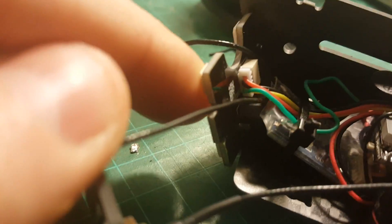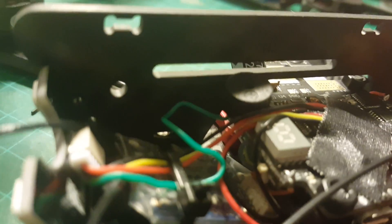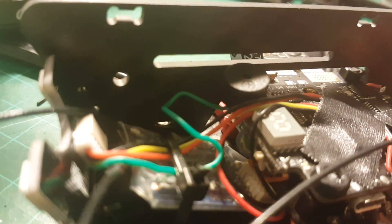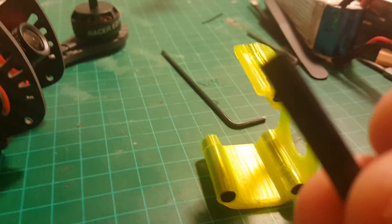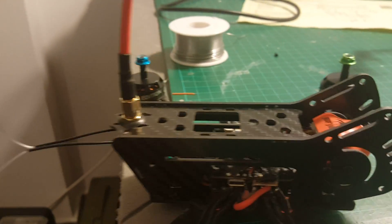I've also connected the LED, and it has a built-in buzzer, so now I actually have two buzzers on the quadcopter. I had to connect the buzzer wire to the minus port — so don't connect to plus, connect it to ground. To secure the camera I'm putting this cover, which requires three spacers inside the plastic cover.